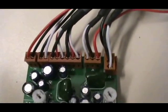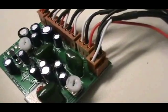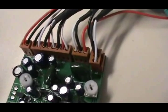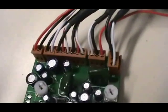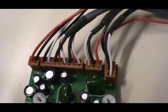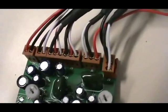Pin number three is the transmit push-to-talk pin. The red wire from J1 and the black wire at the back of J2 both go to pin number three. That completes all the wires going to the microphone plug. To recap: the white wire from J2 went directly to pin two; the white wire from J1 went to the audio wire removed from pin two; the middle black wires from J1 and J2, plus the black wire from J4, all went to pin one ground; and the red wire from J1 and black wire from the back of J2 both went to pin three.